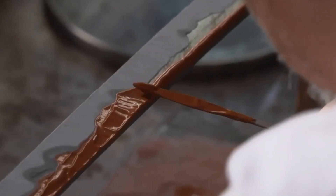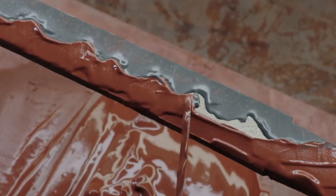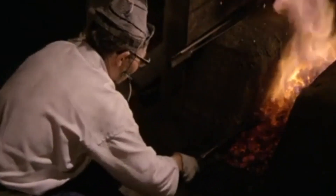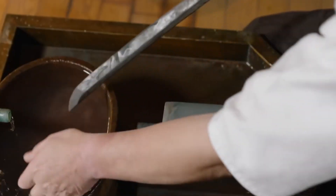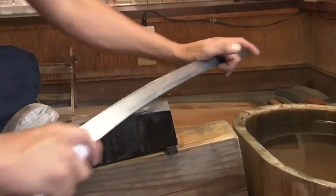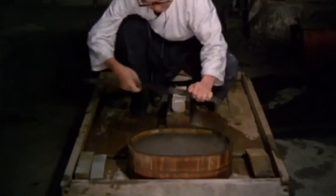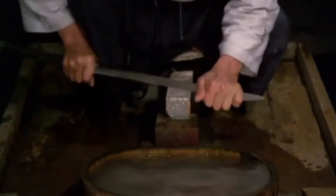This was done by applying a thick mixture of clay, sand, and ash over the spine, while a mixture including coal dust was spread much thinner over the blade. After the heating and cooling process, the katana achieved both a hard edge and a flexible spine. But without the final phase, a katana had no sharp edge — it needs polishing. Polishers use various stones of different grits to polish different areas of the new shiny katana.